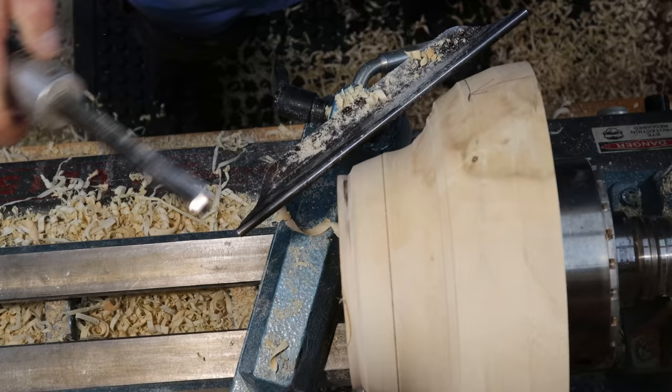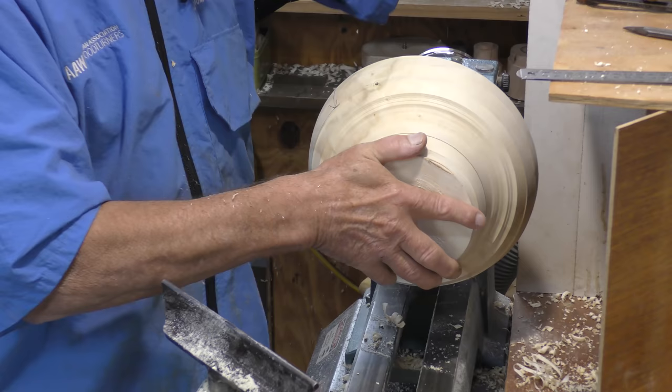I must be getting fairly thin in there now — where's my arrow? Still there. It's not looking hopeful. It's still there, so I think probably with this bowl it's going to be more use as a chuck. I'll just measure the wall thickness. I never see any point in making a bowl with a great split in it — doesn't matter how much epoxy you put in there, it always looks like a split bowl. So I've got probably enough to persevere at the moment, another three-quarters of an inch of wood to go. This split hasn't retreated at all, so you can imagine it's just straight up in there. I'll have that as a kind of datum line, go down from that about half an inch — just using the wing of the tool and nudging the end of the handle around with my hip. No, it's still there, so I'm just going to abort that bowl and we'll do another one.